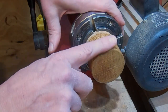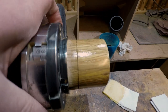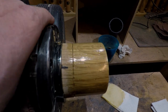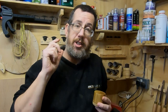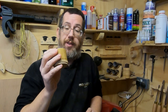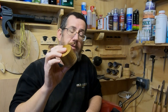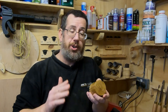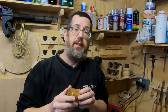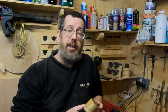After five to ten minutes it's totally dry, really hard, and a lot smoother. I can still feel the grain texture, which is nice. You can apply a wax polish over this if you want, but first I'll just take off any last bits of dust particles with a clean kitchen towel and buff it off with the lathe spinning. We now have a really really glossy nice finish that took about 30–40 minutes. Compare that to spray lacquer, where you'd need 20 minutes between coats and 24 hours before it's fully ready. It's a really quick and easy method, and you can get an even more glass-like finish with more sanding and buffing.